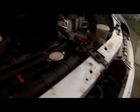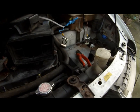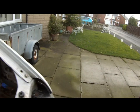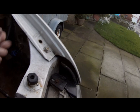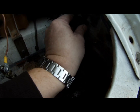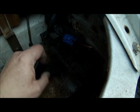We're almost back together again, we've only got the batteries to put in. I'll take the transistor out and show you inside. We'll put the batteries back in and the air intake back in. And then on the relays — the relays need to clip back on and screw on. That one doesn't actually screw on, it clips on. On the actual relay itself there's a slot and that slides up there. So you've got to remember to put your rubber boot on, clip your connector in, and then slide your relay onto the bracket.